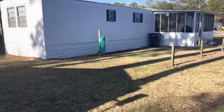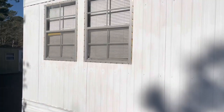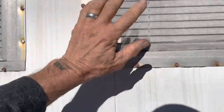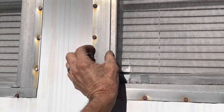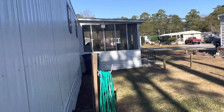This is what I was hoping to do — I'm going to show you the neighbor's house. This is what the windows looked like in the original house: nail flange and all. This is basically what a new construction window would look like, except nowadays it would have a brick molding on the outside if you wanted, or just the nail flange — but the window would come out a little bit, like the atrium windows or even the Pella windows.